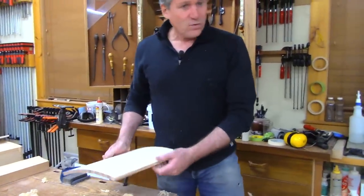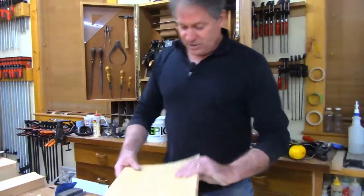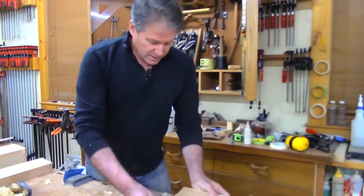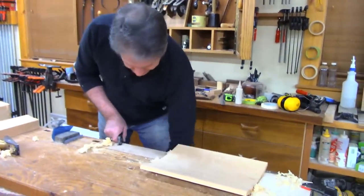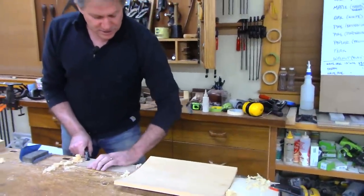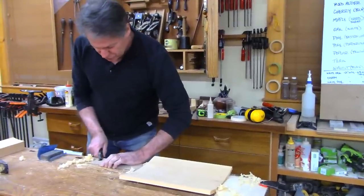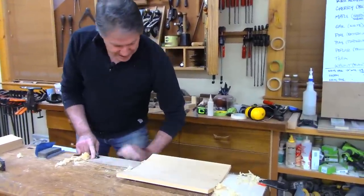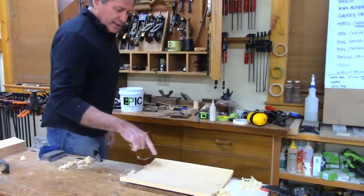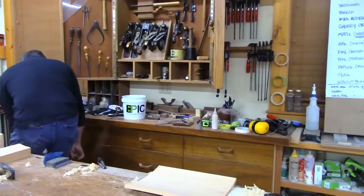Now this will, let me get my... Are you going to smooth the other side? Yeah, that's the tricky thing. So you've got the facets on the inside. You need the old barrel makers' plane, what was it called? A stoop plane, like the word soup, but with a T in there. A stoop plane, which had a kind of concaveness to it. Now, I'm not sure if my scrub plane will fit in there, but let's give it a shot.